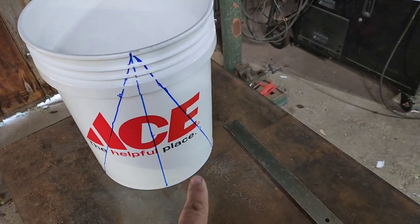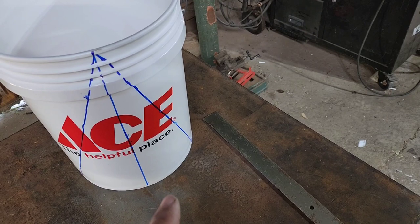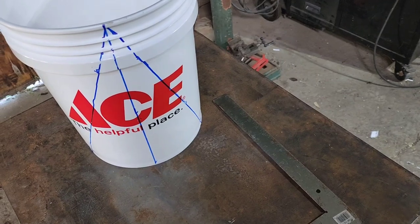Once you get your straight line, measure 6 inches across both ways. It kind of helps to turn your tape measure upside down. So like make a little pencil mark at 6 inches on the back of the tape and it'll roll around the corner a lot easier.